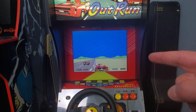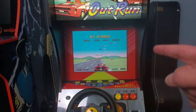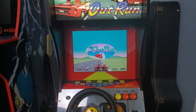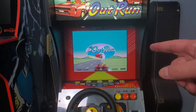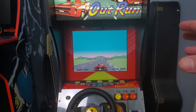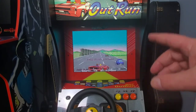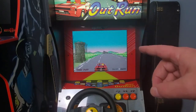Hello everyone, Gesture Tester is back. This time we are taking a look at the OutRun cabinet and one of those annoying problems that come along with it - that loud buzzing PCB fan. This problem has cropped up on many people, it has even affected mine. That loud buzzing could be coming from a bad PCB fan whose bearings have gone bad, in which case you'll need to get a brand new fan.